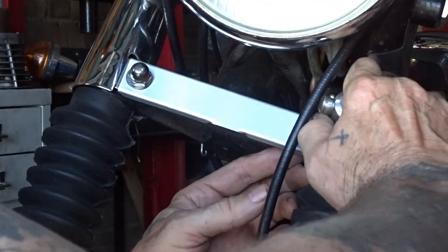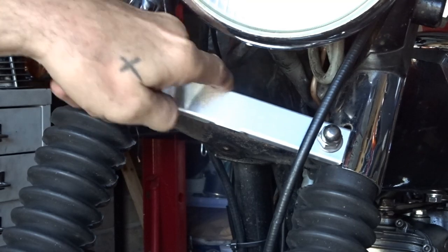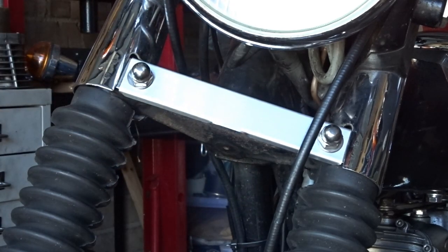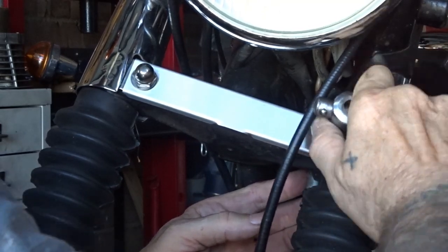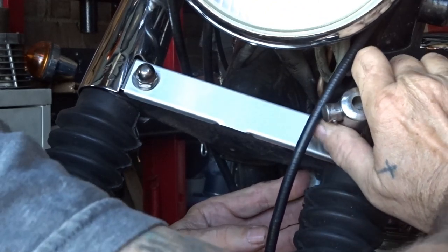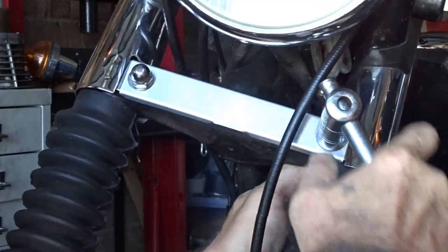The reason the bend is there is that I know some people put cables through there, and I wouldn't want cables rubbing up against an edge of stainless and working its way through the cables. That's why I put the bends on it — not only that, it makes it a little bit stronger. But once these are on, I think they look quite smart.